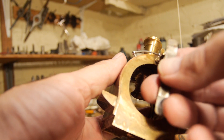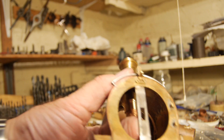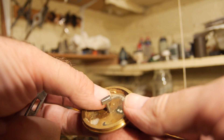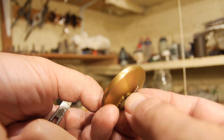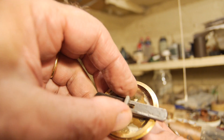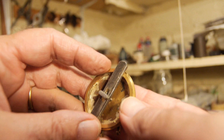The other pieces of the smoke box are the door and the cross piece, which allows the door to connect — you can see it there quite clearly. You've got to make this removable so that you can clean out the tubes at the back of the boiler. The smoke box has a T-piece which is operated by the fingers on the front of the smoke box — like a clock. The cross piece has a hole in it, which fits over the T. The T goes through and locks it in place, then you wind the outside one to tighten the T against the bar and close the smoke box.